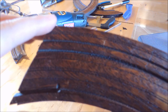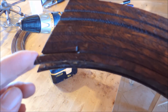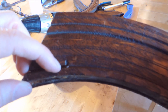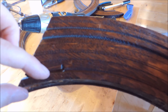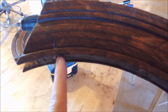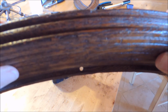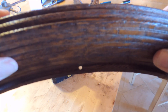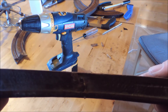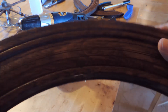Now let's see if you can see this right here. I initially thought that was a tack — a little metal tack — but actually it's a little small wooden dowel that holds the spindles in place. What I'm doing for those is, if I'm careful, I'm able to pound them out. And then I can put in new little dowel pins. Pretty cool, huh.